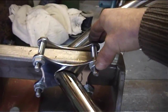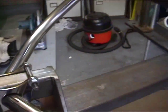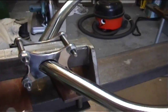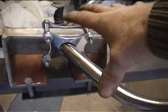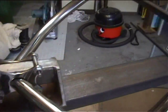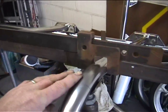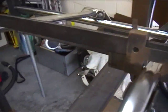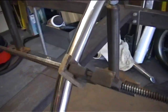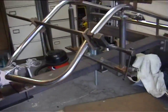The beauty of doing it this way is when I start welding, I'll weld the whole frame while it's all clamped on and everything stays square. To hold these rails into position I'm using a sash clamp — that squeezes and nips the rails in together onto the plates. And on the top here I've got a little jig which holds the side rails to the right width that I want, which is the same as the back — whatever width is at the back is what I make the width at the front. It's on some temporary legs so I can move it out of the way when I'm not using it.